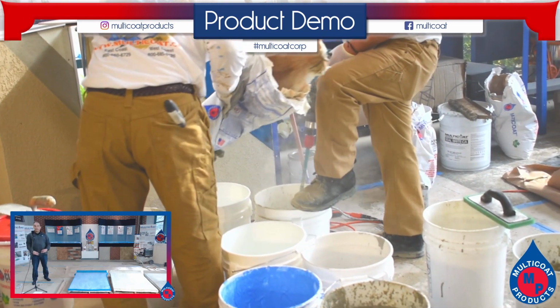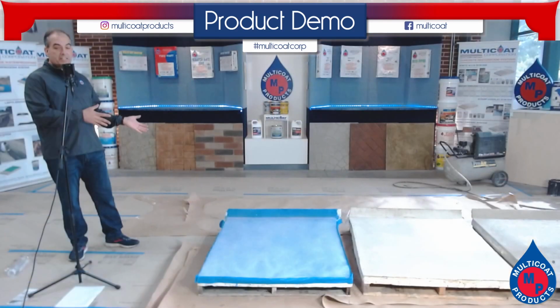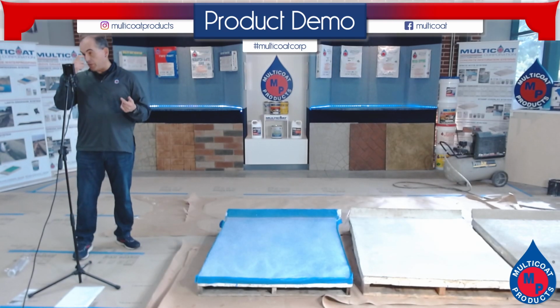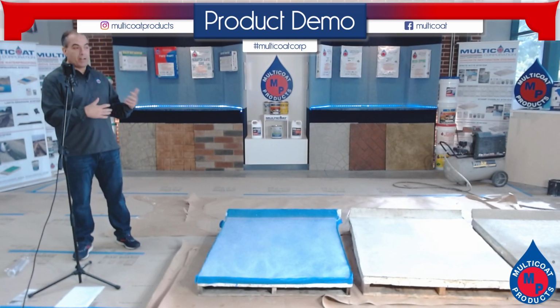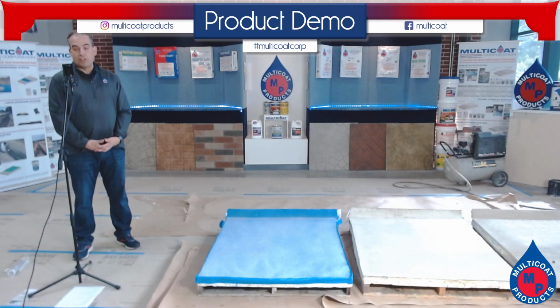But if you were somebody that wanted to put tile or pavers on these decks, you could put a coat of our scratch coat product, and then you could put our Thinset and any tile or whatever look you wanted.